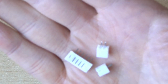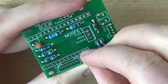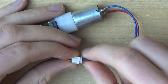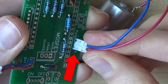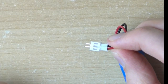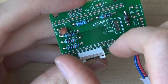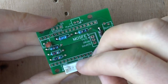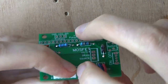Now back to the PCB, which receives its JST connectors for the pump, battery, and the water level sensor in the next step. Just like with the battery cable for the ESP32, check the correct orientation of the connectors first. Connect them with the battery and the water pump respectively and make sure the red cable goes on the copper pad marked with the plus in both cases. Be careful not to touch the battery pins to avoid a short circuit — better don't plug it all the way in. For the water level sensor the orientation of the JST connector doesn't matter. The connectors have to be soldered from the back side. A good trick is to put all three of them on the PCB, then turn the whole thing over and place it on the table.